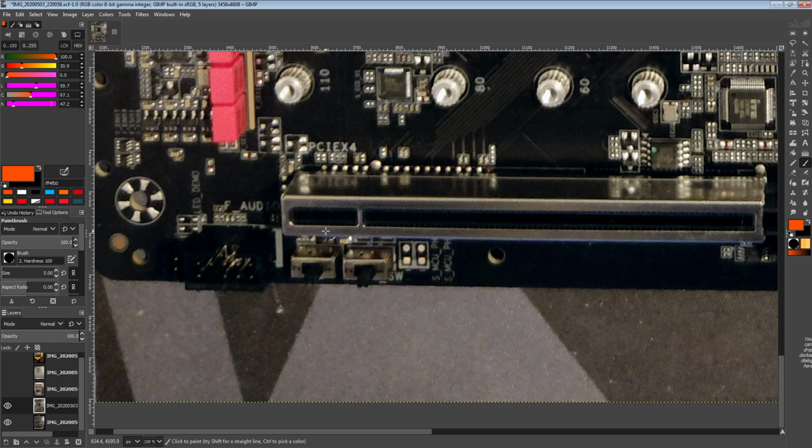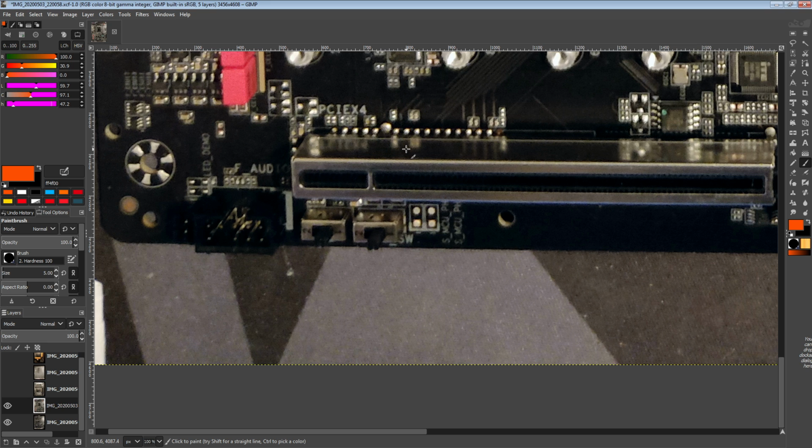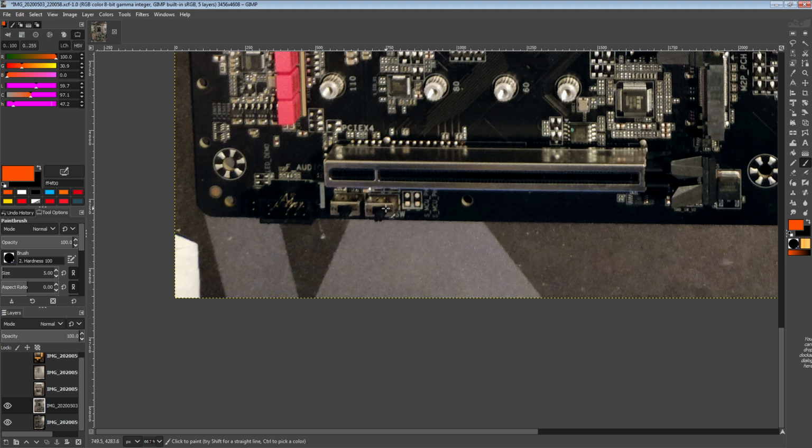And then, of course, because Gigabyte themselves acknowledge that their automatic dual BIOS system is stupid and annoying when you're overclocking, their high-end motherboards that have the automatic dual BIOS also have these two lovely switches over here. One of them disables the automatic dual BIOS functionality. The other one allows you to select which BIOS chip you're on. And if you're buying a high-end Gigabyte board that has these two switches, I strongly recommend the first thing you do when you pull the board out of the box is you go into the manual, you figure out which of the switches puts the board in single BIOS mode, and you put the board in single BIOS mode so that you don't have to deal with the automatic BIOS switching.